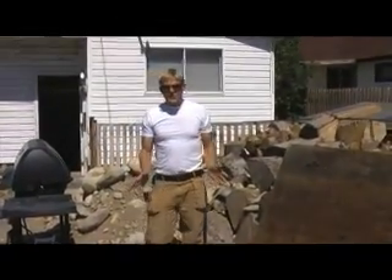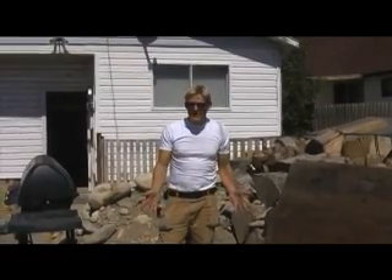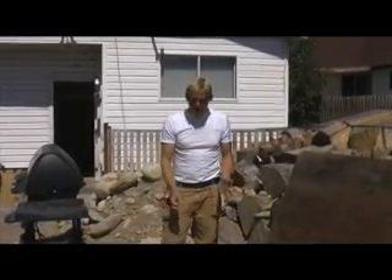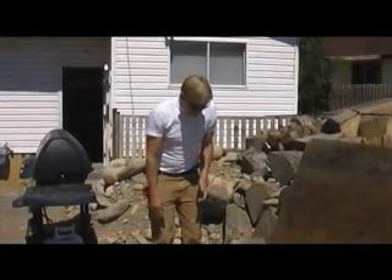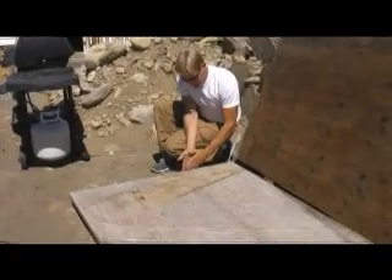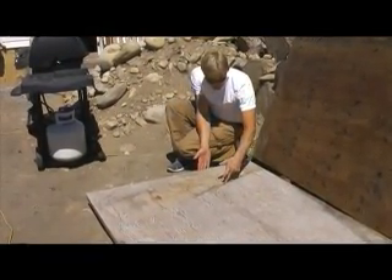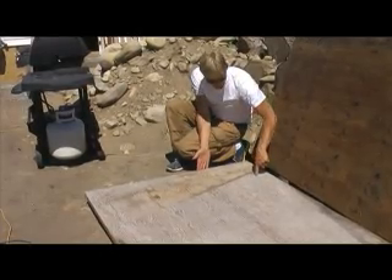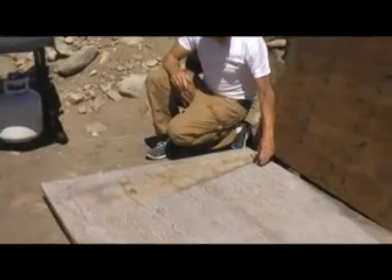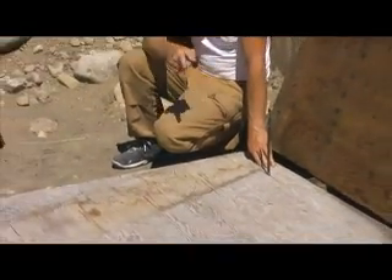The beauty of using this particular system is that you're creating a mirror image, which means it has to be perfect. It has to be perfect because when you cut through one sheet, you're marking the second sheet. If this represents the bottom of the wall where the sheet of plywood would be resting on the bottom of the footing, this is 12 inches up to the center where these ties are going to be going through. We're going to go through and cut all the marks laid out on the plywood.